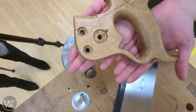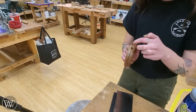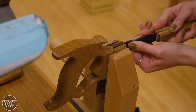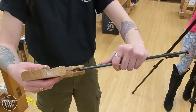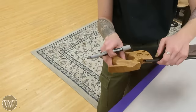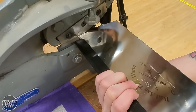Once the back gets worked on, we make sure everything is in the right position. You want a slightly shorter distance up by the toe than at the back. If it's not exactly where you want it, you can tap it around — they have nylon-faced hammers for adjusting the back. Speaking of white oak, here's the handle. The handles are made outside and they make them individually so you can size them to your hands. You can actually order a handle to fit your hand size, which is very important if your hands are larger or smaller. We need to make sure there's a nice clean fit, but there's a gap when it goes all the way in, so we need to cut off a little bit of the back plate, put an angle on it, and shear off that little bit so the back will slide all the way back into the saw.